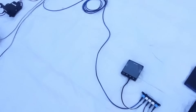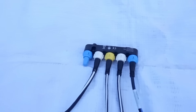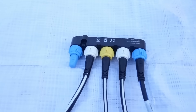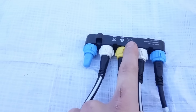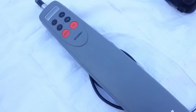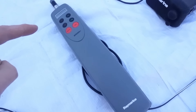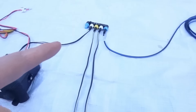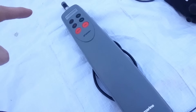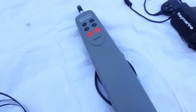Now let's follow this network wire over to the other side. It's quite a long cable but it's got to run the width of the boat. On this side it connects into another one of those bars, but this bar is slightly different because it also converts the signal to the new network — specifically for this yellow cable. Inside this block there's circuitry that converts the signal going through this yellow cable, which runs into my ST2000 autopilot. It has its own 12 volt power supply, separate to the network.